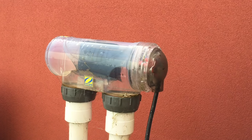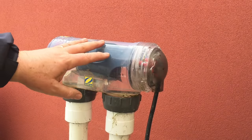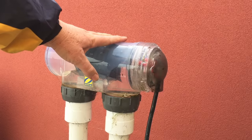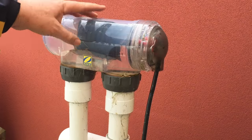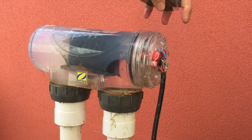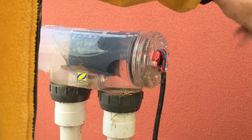We're going to show you how to clean a saltwater chlorinator salt cell. A lot of cells have this design here where it's a canister up on the top. It's very important with saltwater chlorinators that your cell is installed in a way so that it creates its own little air pocket up here. With this chlorinator there is actually a little cap here just over the wires.